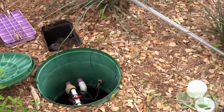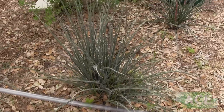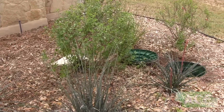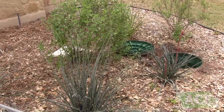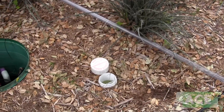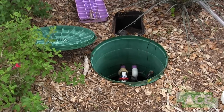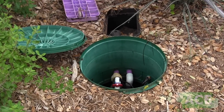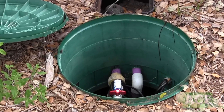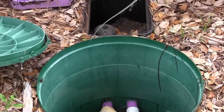If we smell an odor out here, most of the time the problem is with the air compressor not compressing enough air — you would have an odor, especially if the compressor went out and then we repaired it and it has to retreat the effluent inside the aeration chamber. If you smell an odor inside, generally P-traps may be vacant of water, and that sewer gas, rather than venting out the roof vent pipes, will find the path of least resistance and come back in the house. Just turn the water on for 30 seconds once a week and you should be fine.